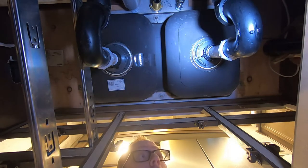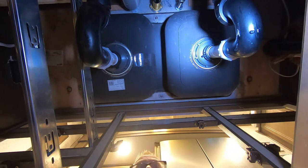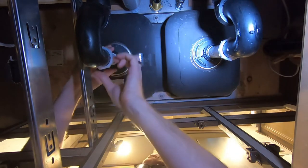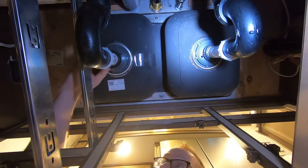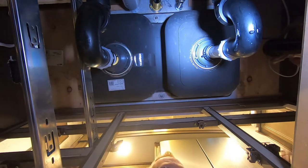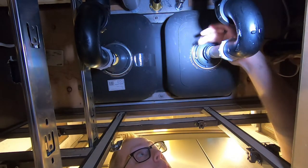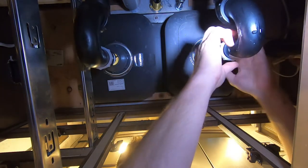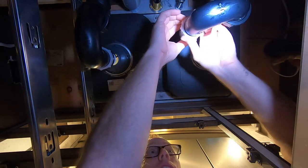When doing a repair like this, especially where you've got sealant that is old and worn, you want to go ahead and get all of that sealant off. To do so, I'm going to need to disassemble the sink in its entirety and hopefully get it out. So I'll be taking off the parts where it connects to the plumbing. Your plumbing probably looks a little different — I've upgraded ours — but generally the process is the same. You'll disconnect whatever is connected to the bottom of the sink and get things out of the way so you have room to work.